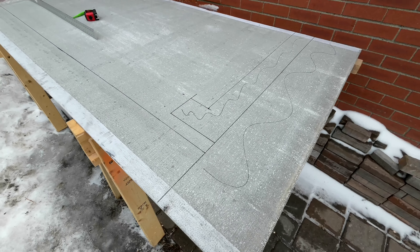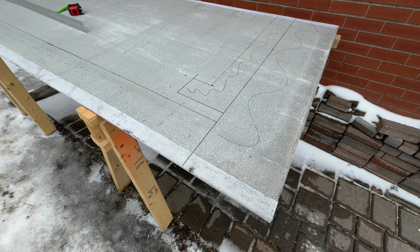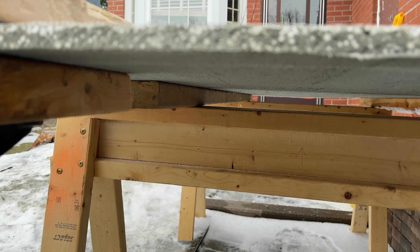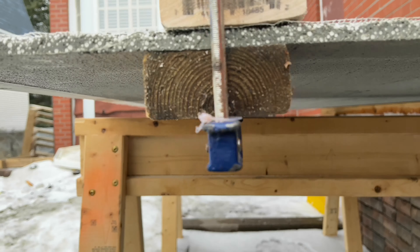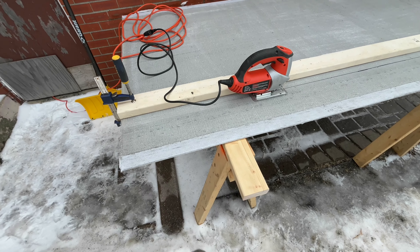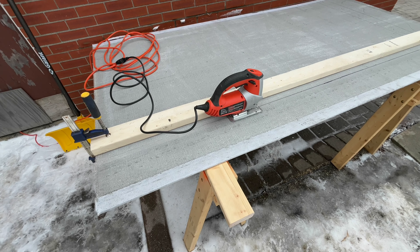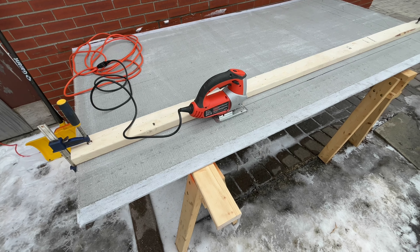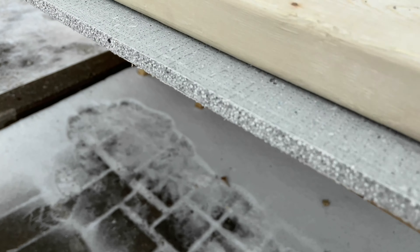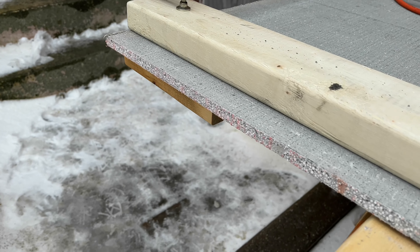So it's all marked out — this is the cutout for the tub, and hopefully that all works out. The squiggly lines are what's being removed. I have another board underneath to stop it from sagging on the end. I set up a guide for myself and put a block underneath so the end wouldn't drop. We're using a Diablo blade I bought from Home Depot, and it's cutting through this thing like butter. Here's the cut edge using that Diablo blade with the skill saw — that's ridiculous. Yeah, I can certainly live with that.